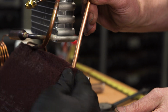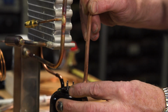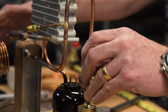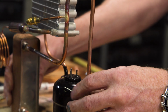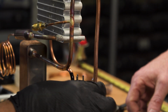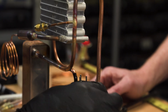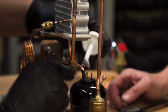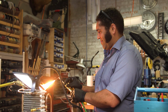These are the other 2 tricky joints because heating up a painted compressor. Right. With oil in it. Yes. It always is fun. And okay, that's as deep as that one's going. So again, we could just do regular because it's so clean, because it's clean and it's copper to copper, but I think you'll enjoy the shiny silver finish of all the brazed joints.